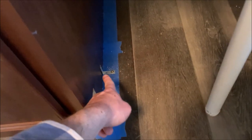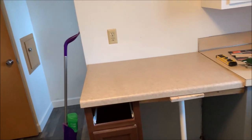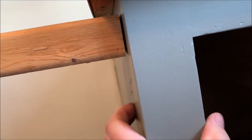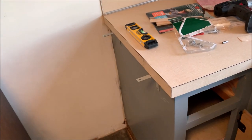I put that down there to hold the bottom in place. The top still wants to go in like that, but once this is all secured down it'll do that. I just have a 24 and 1/8-inch piece of 2x4 going across to hold it for now. I put some blocking in here — it's not pretty, but it doesn't have to be. It's just so I can screw those L-brackets in. About half to three-quarters of an inch, just a little extra to be safe. I put these L-brackets on — that's going to hold up that side and connect to the blocking.